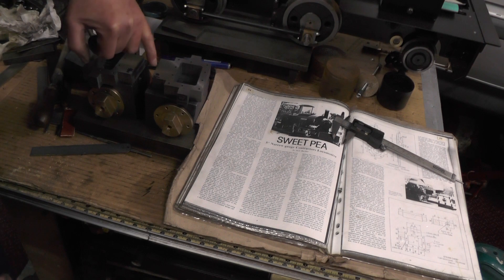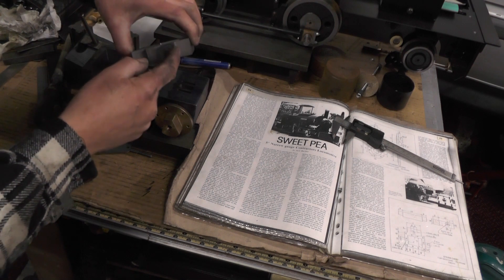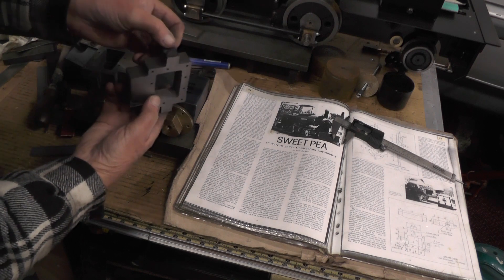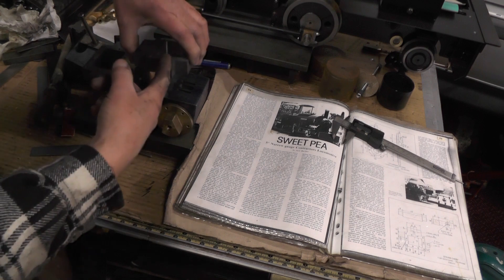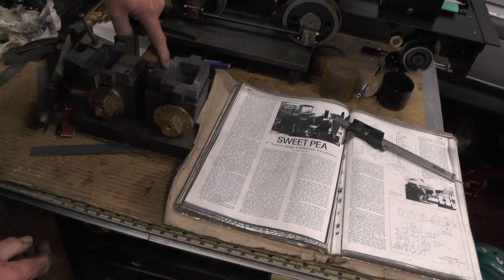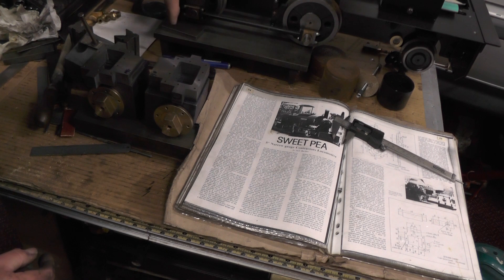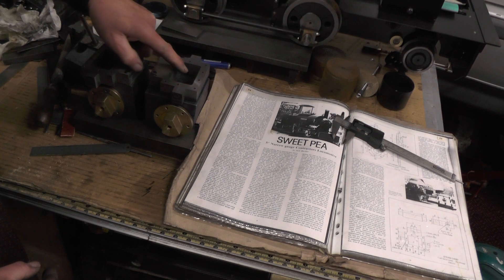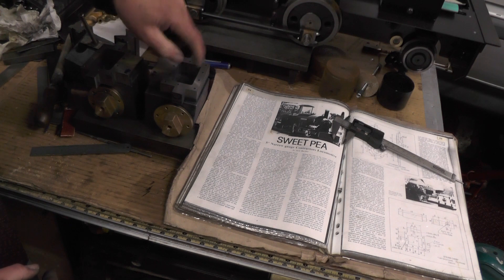This is the time to mark them all off — offside and near side. I've got to machine this diameter which is offset to the thickness on each side for the valve spindle, and then the steam port or steam hole needs drilling in the top and then at an angle to meet the ports.